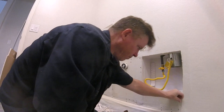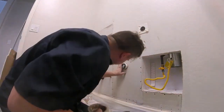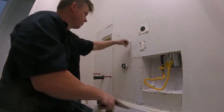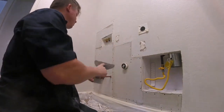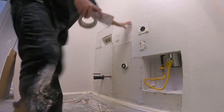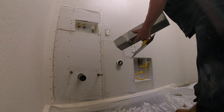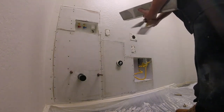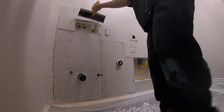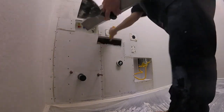So go ahead and just buy yourself a fiberglass roll of mesh tape. 100 foot, 300 foot, 500 foot. They sell a lot of different types out there, yellow ones, blue ones, green ones. Just get the regular fiberglass mesh tape for your drywall repair projects. Easy go-to material. And you're less likely to have any problems or errors after you mud. Get everything all taped up. Double check everything. Make sure you got every gap taped up, every seam, everything.